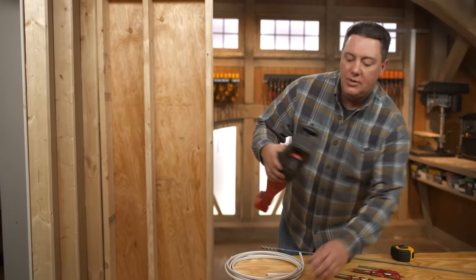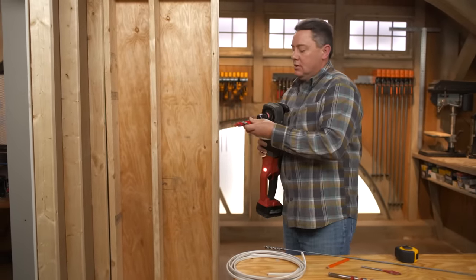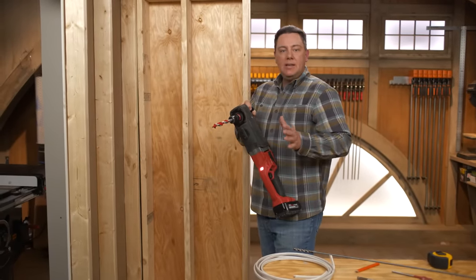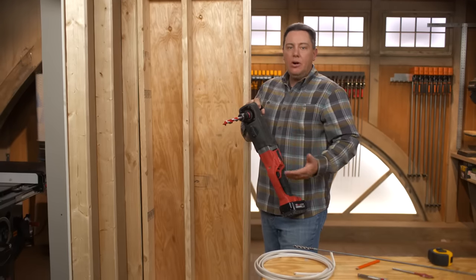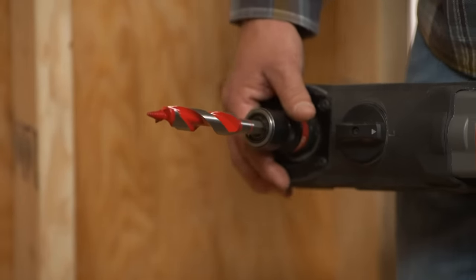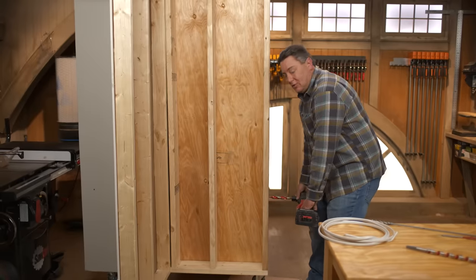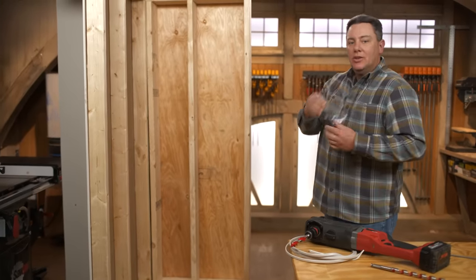Let's go ahead and show you how we do this with an auger bit. We know we have our inch-and-a-quarter minimum clearance, but I also like to keep everything at the same height. It makes it easier for a point of reference if you need to cut anything in, and if someone's drilling through a wall from outside, they know roughly where the wires run. The quickest way I've found is to use right about here on your leg as a guide — it gets you into about the right spot. So I'll put the glasses on and drill a couple of holes.